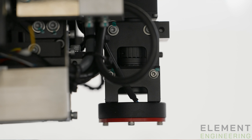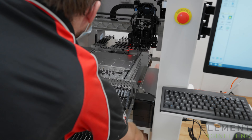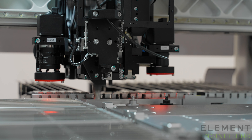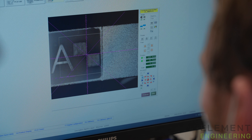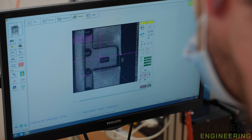They're jumping around on the machines — we've got a few little teething issues at the moment. There are different heads and different cameras that need to be effectively dialed into their exact positions, because we're looking at things on the half-millimetre size scale. When the guys run the machine through its different operations, it's effectively finding the exact positioning of the camera relative to the head, taking into account the positioning of the machine, the floor, and any flex. It's also running the general systems up and making sure everything moves as expected, but that's the easy part.